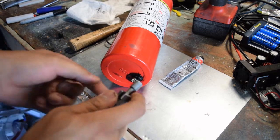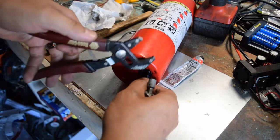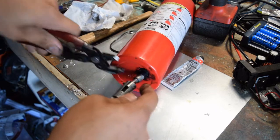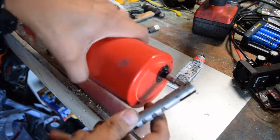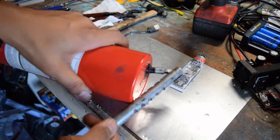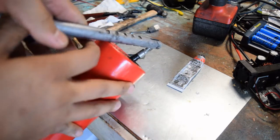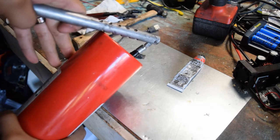This is our valve stem puller. A little help from the handicap department. Okay, now that we're threaded onto the valve stem, right, you're going to want to set one of these little edges on there. You could do this without it. You could do it with a pair of pliers. However, I just find this much easier. And you're going to pull this thing straight out, and it will seat into place.